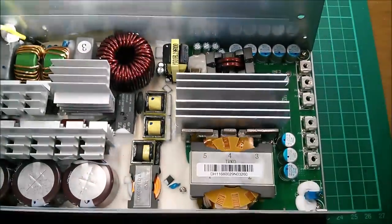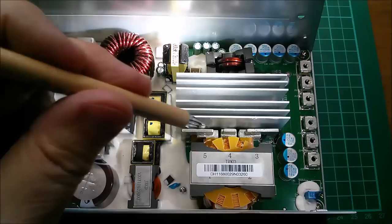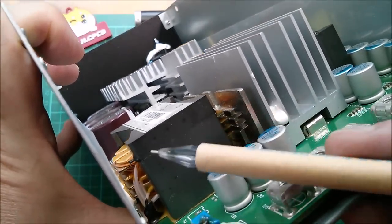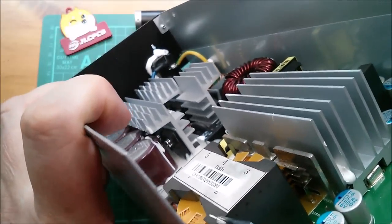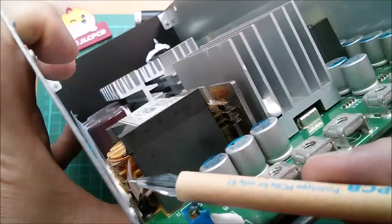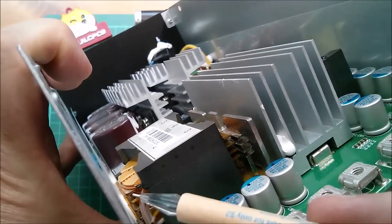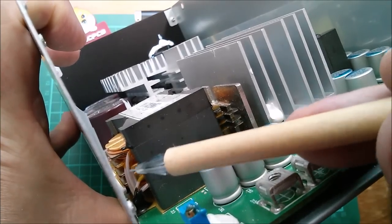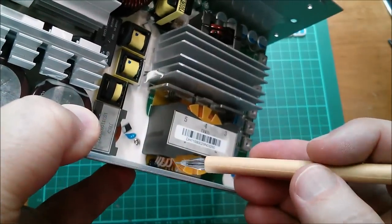Finally, there's this incredibly strange inductor. It has a ferrite former and then what appears to be five layers of fairly flat multi-turn windings — you can see the wires there. There are five layers with four separating metallic strips and insulators in between, which look like Kapton tape or possibly mica. All five ends appear to go down into one connection point, and it's the same on the other side — five visible wires from the five layers down into a common point.